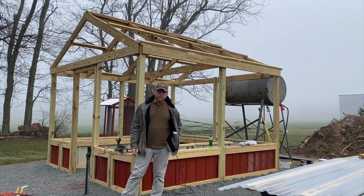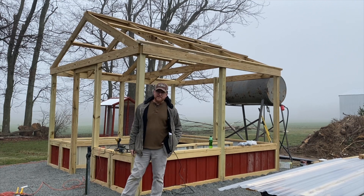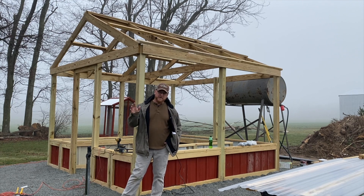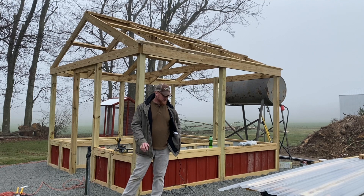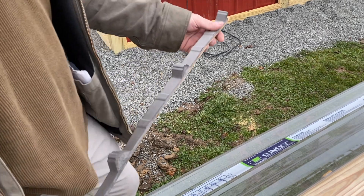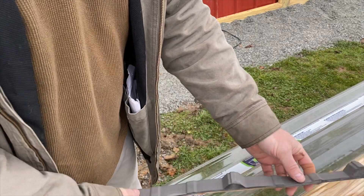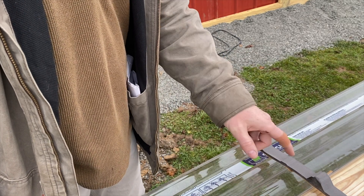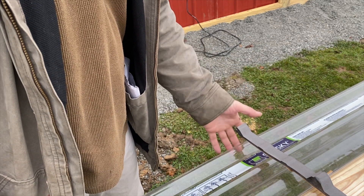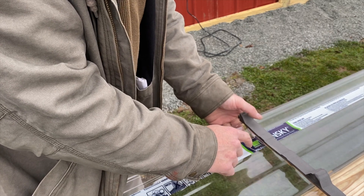It's a damp, foggy, cool St. Patrick's Day here on Bar Run Farm. The upper structure is complete — the roof structure is complete, got the purlins on, got the trusses up, and we are ready to put sheeting on the roof. We're going to use a corrugated polycarbonate sheet. The manufacturer recommends putting foam backers underneath each rib and every place we screw it down, and we're going to pre-drill each hole to avoid cracking the polycarbonate.